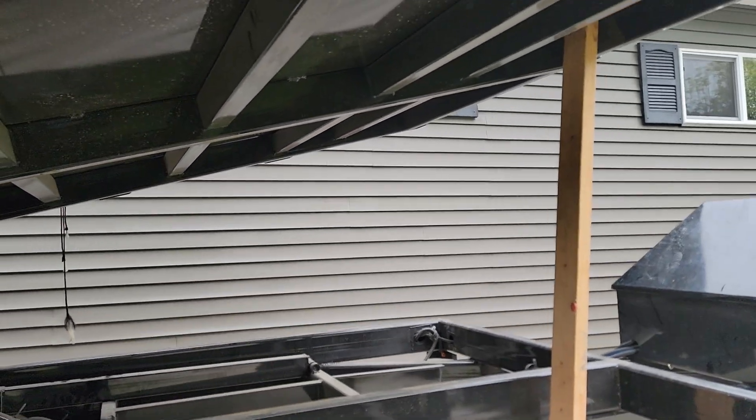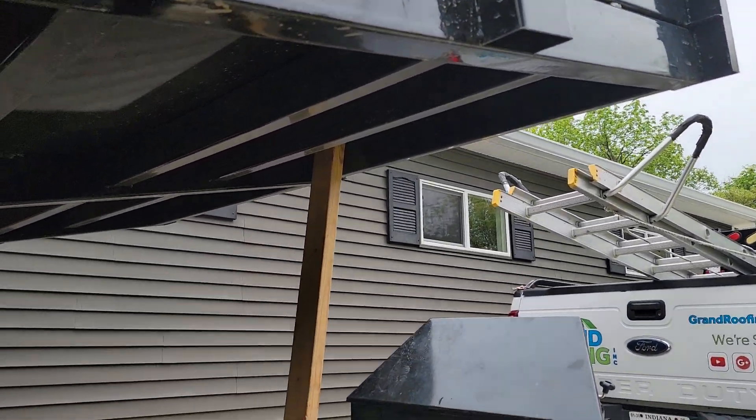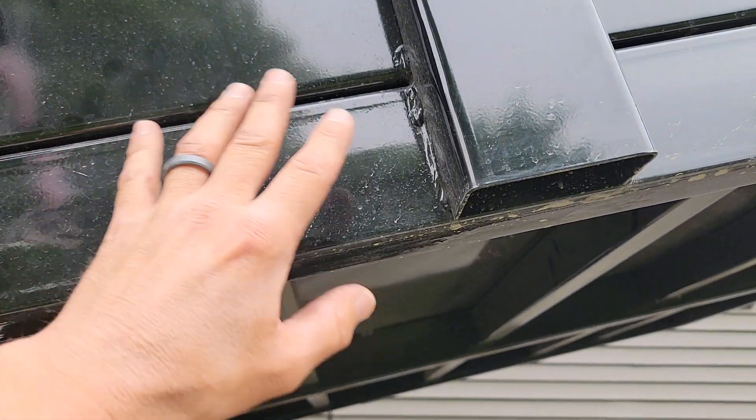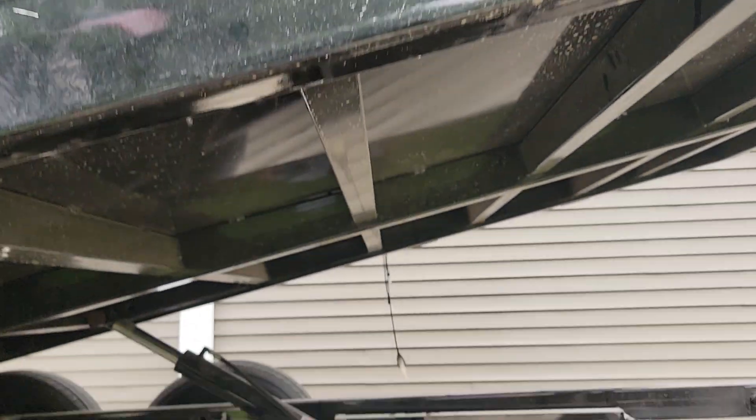Don't let it rest all the way down. You'll notice I also have a two-by-four here — I'll explain that in a second. You want to make sure those safety supports are up and there's no weight in the trailer. Dump your trailers before working on them — there's plenty of weight just in the metal, so empty them first.